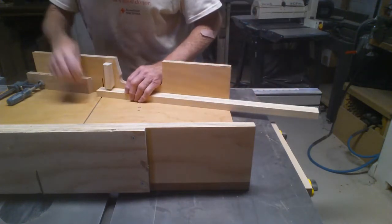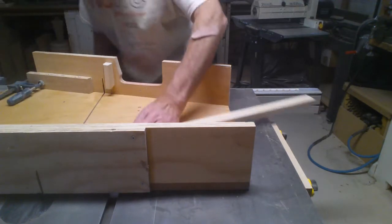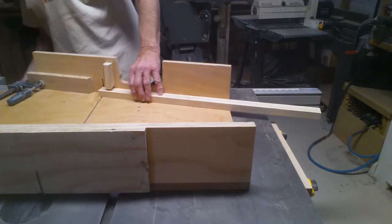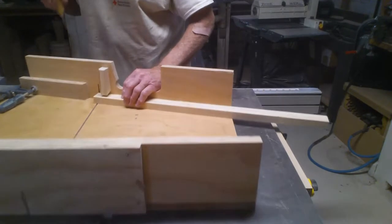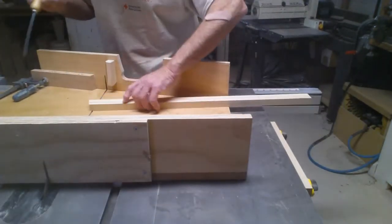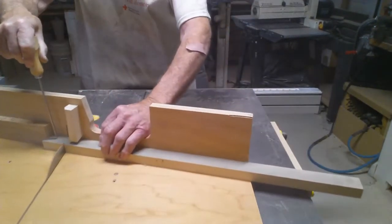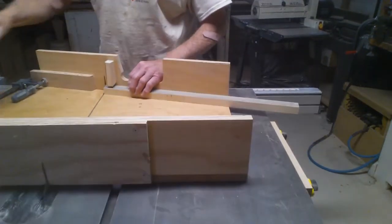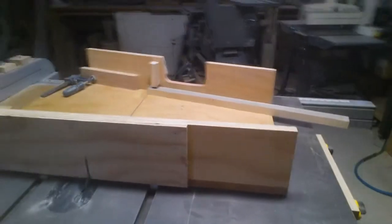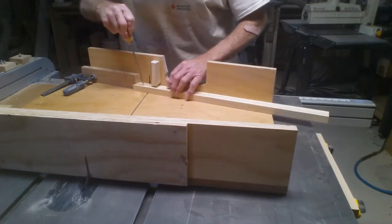There's my red line and my non-red line. First I get my hand through the hole so I can grab everything, double-check everything, make sure the blade is high enough. I take off just the starter end — just a small amount — so I can push it against the actual fence that's got the angle on it. I do one, flip it, do another one, and put it over there.